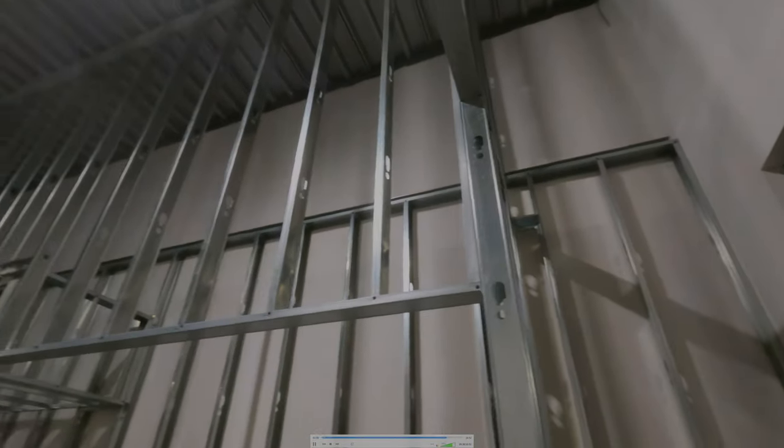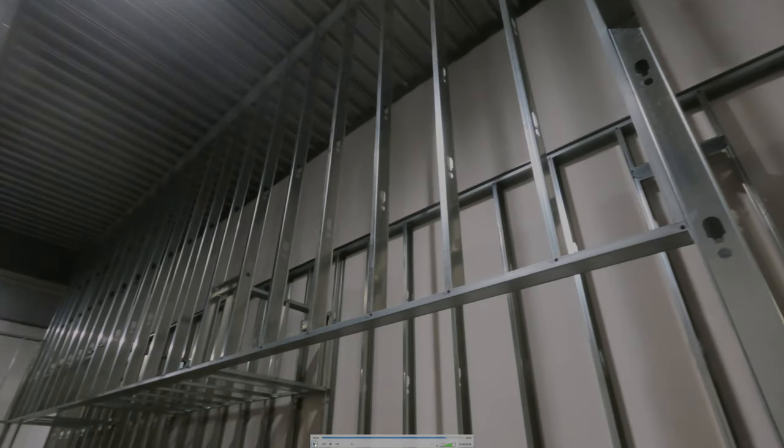We're bracing right now and setting that last one — you can see it's not straight yet, but once we get the bracing in we have a couple of other little walls coming in. We have these little other returns coming into this wall, and this is getting straight just by using these little walls — we don't have to use external braces, these are the braces. When we know this bottom track is straight on the line, that's when we finish screwing off the overlaps and the fishtails.